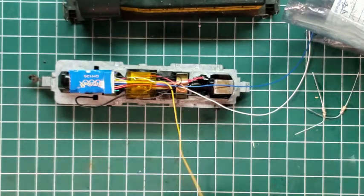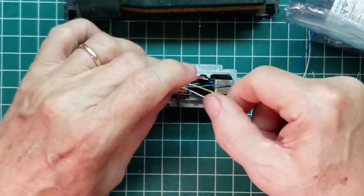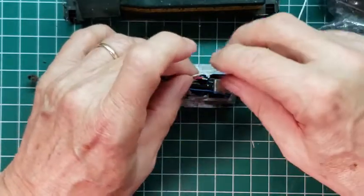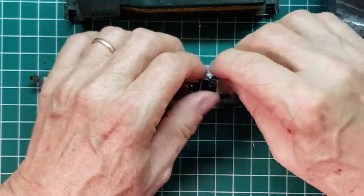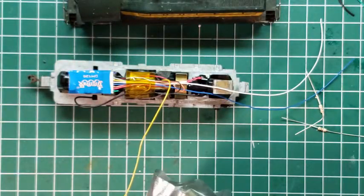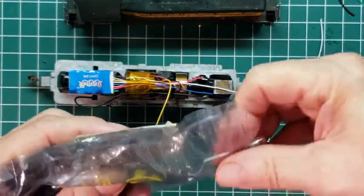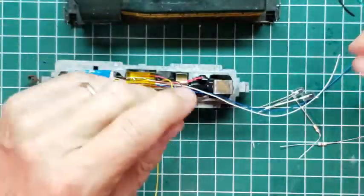So let's go ahead and take the two LEDs. I could write that on the card, but I'm not going to do that. Don't want to share with you who the customer is. But so here we got plus and minus. We always put the blue is always plus, white is always minus. We always put the resistor on the minus. Not necessary. I mean, it could be plus or minus. At the Train Buddy shop, we always put it on the minus because that's the individual LEDs, or one of those goes to each individual LED.